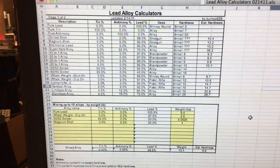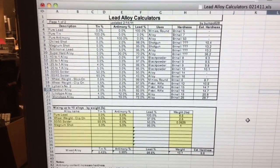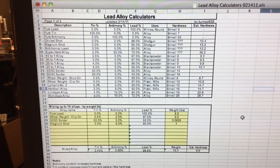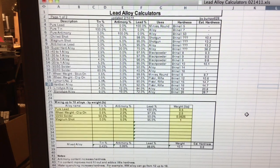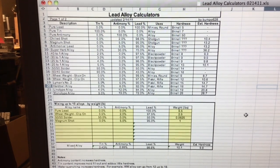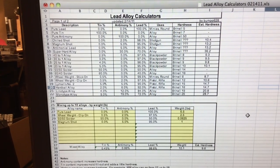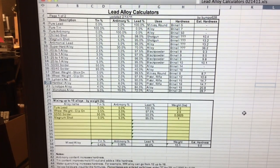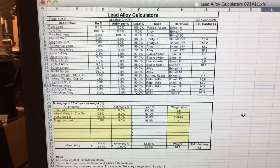However, you should know that shooters and casters who subscribe to this calculator sometimes have a problem with the RotoMetals site, because RotoMetals' formula has 8.6 for the BHN of pure lead. You'll see right at the top there on line 4 that this spreadsheet has a BHN of 5 for pure lead. There's some debate about one side accepting and not accepting the RotoMetals side. But really there shouldn't be any problems with that, because we'll show you later on that it really doesn't make that much difference. Let's discuss the BHN of pure lead just for a little while — is it 5 or is it 8.6?